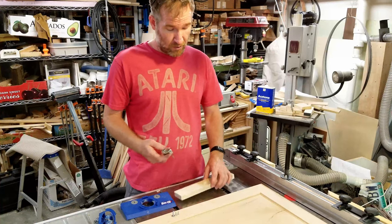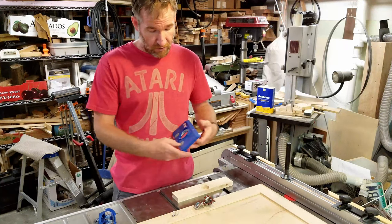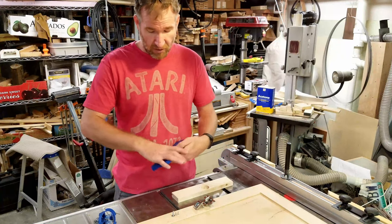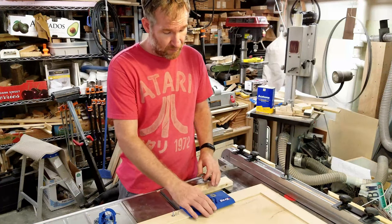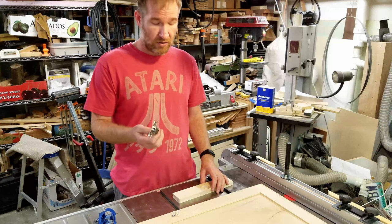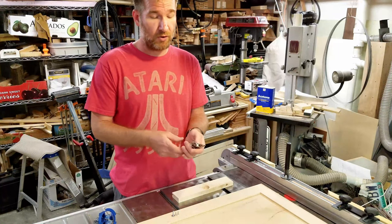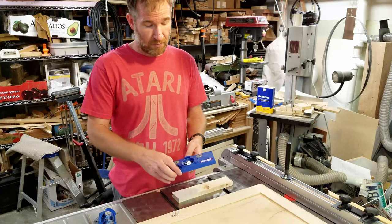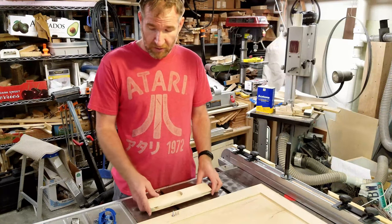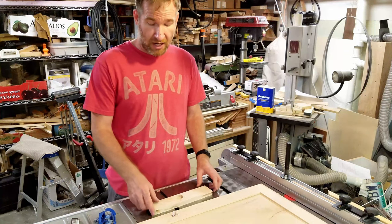The hinges call for a 3 millimeter distance from the edge. They have cams that you can adjust to the right millimeters by turning them — when you push them up against the frame it gives the correct spacing. When dealing with hinges, always make sure your hinges are compatible with the jig because not all the holes may be the same. In the case of my Blum compact hinges they line up perfectly. Just follow the directions for assembly and usage on the jig and it works wonders.